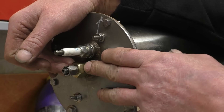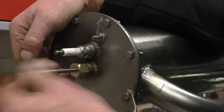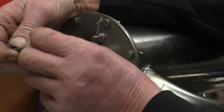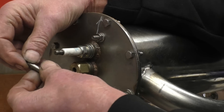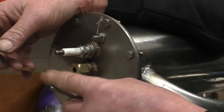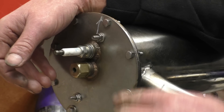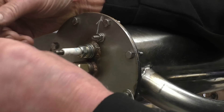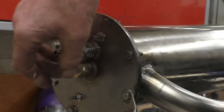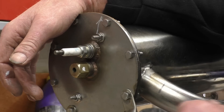I'm going to drill a hole in there and put a bolt in to be able to lock that tubing in position. And I'm also going to drill some little holes in the end of here — cross-drill with a 1/16th drill probably. Start off small and work bigger as it goes on. I'll put a little mark on there — that's the flat I want to put the locking bolt in. You will get a little bit of leakage out past the stem of the jet going in there but not a great amount — it'll do no harm.